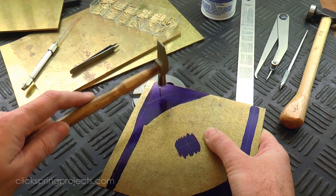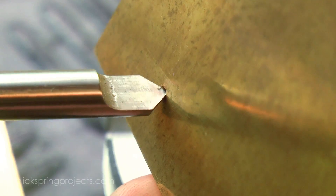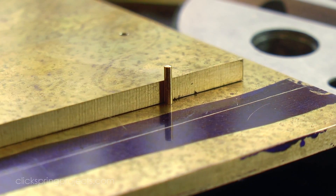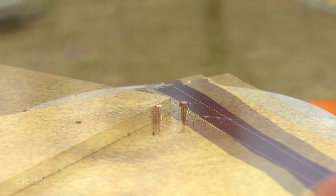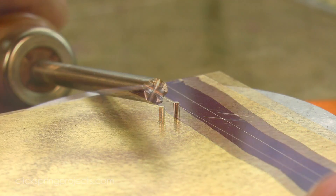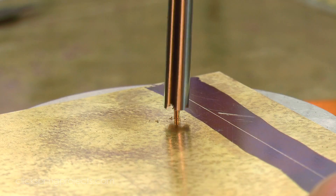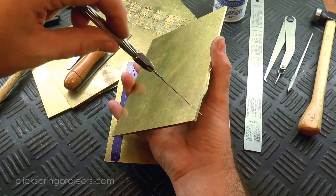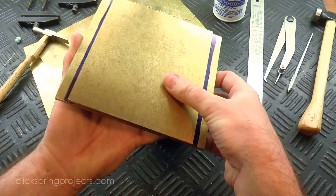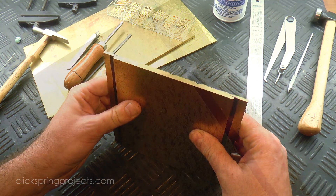The pins were then hammered firmly into place and the opposing holes on the other plate given a light countersink. Now for the plates to all sit flush when stacked, the pins must sit beneath the surface of each matching plate. So I used a file to reduce the pin length, and then rounded off the tops using a shop-made chamfer tool. The two plates are now well registered, and the pins sit comfortably inside the opposing holes.